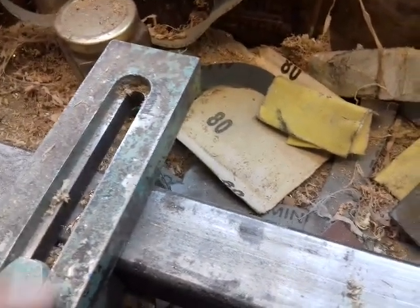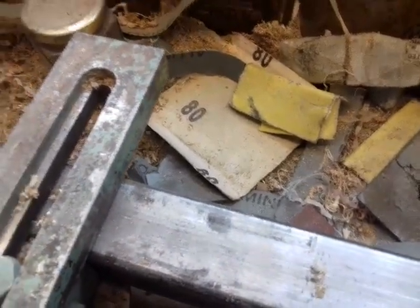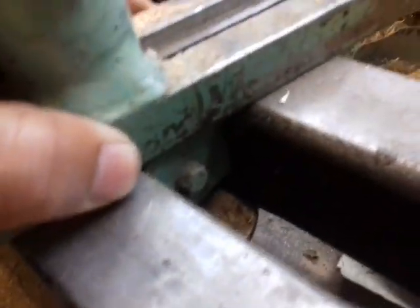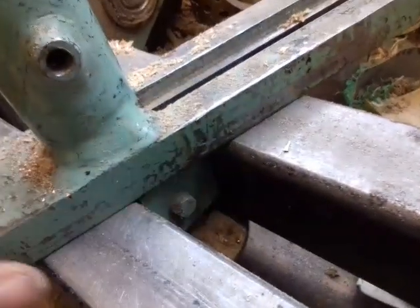The actual rest is made out of a 2-inch by 3/4 inch solid steel bar, milled out to take a standard 17mm head bolt, which goes down through a little block in the middle there. You can see the block. It's got a nip screw which stops this bolt from turning for tightening up. And on the bottom, I think I've got one here somewhere handy. Yes, I have.